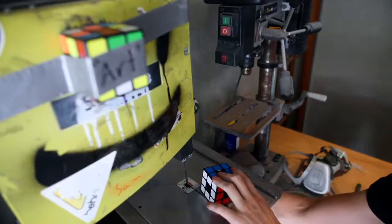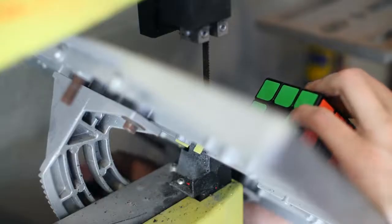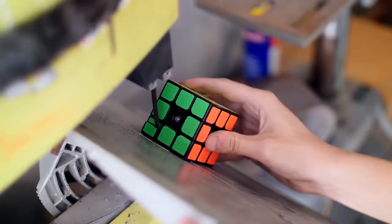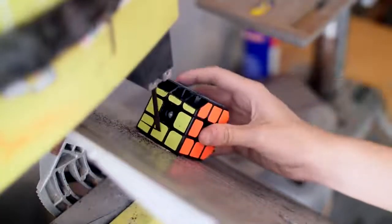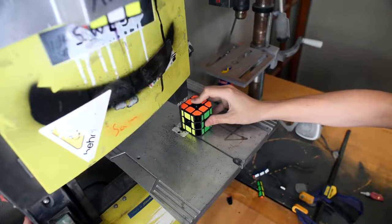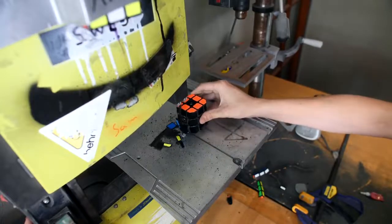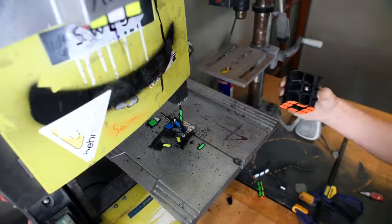For now, all I have to do is pretty much the same steps as making a regular barrel, so I tilted the table on my bandsaw to the holiest of holy 45 degrees, and then I cut 4 of the edges off. After I did that, I tilted the table back to flat, and then I cut 4 of the faces off. The reason I was doing this is because I wanted to open up the edges so I could just stuff all of the pieces full of epoxy sculpt now, that way I wouldn't have to do it later.